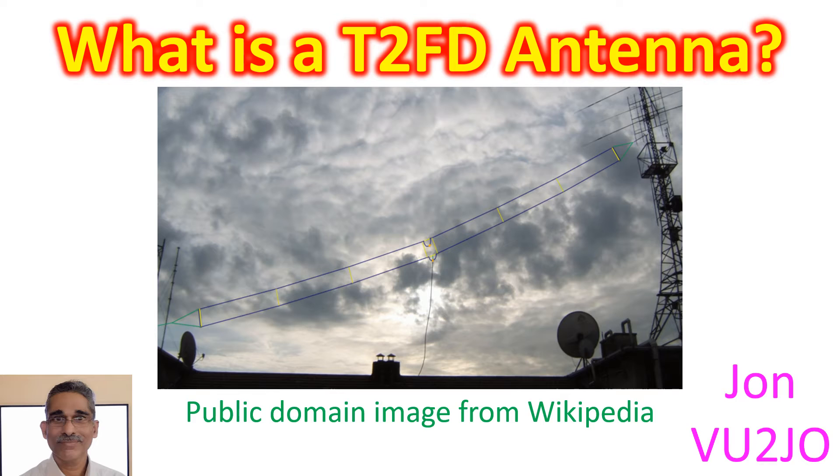But it is a compromise antenna with gain much lower than a resonant dipole antenna on the lower bands. Efficiency of the T2FD antenna is low, with up to 30% of RF energy being lost in the resistor. It was used by radio amateurs in the 1950s and later went out of use, only to return with the allocation of multiple new frequency bands which are not even integer multiples of previous frequency bands.